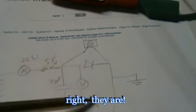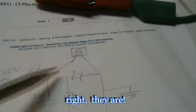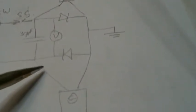Okay, I have corrected the little diagram. The bulb is moved to here and the spark gap here at the plus. It's not an electro gap, but the spark gap. The diode makes it positive there. Probably these are also the wrong way around. Okay, so I had hooked up the scope across this diode, and now I have changed it to this one.